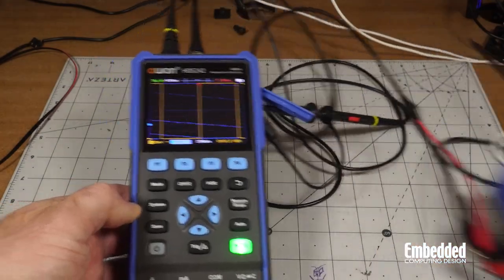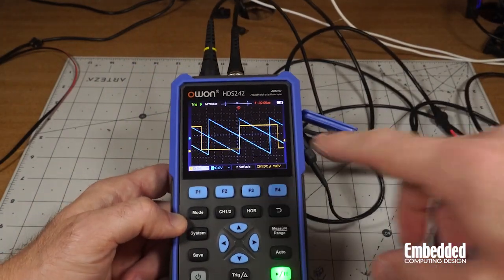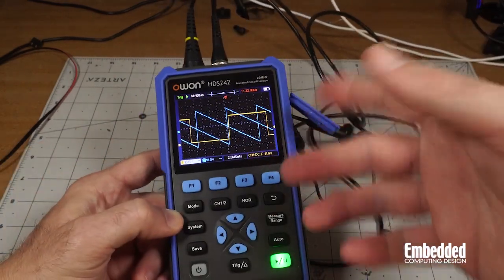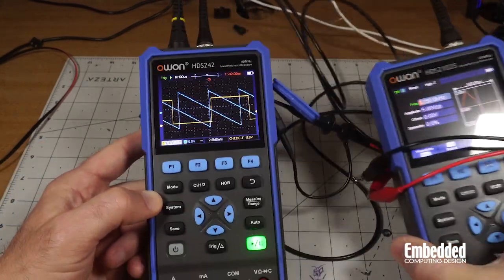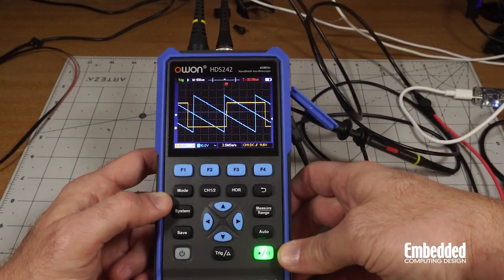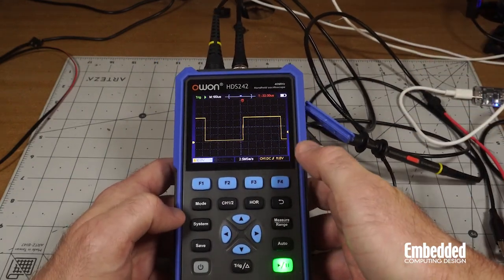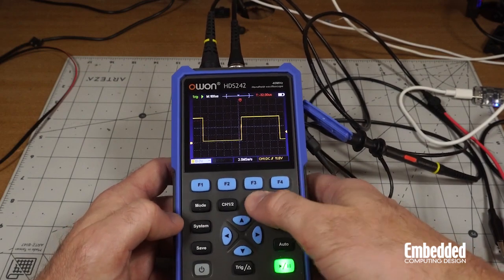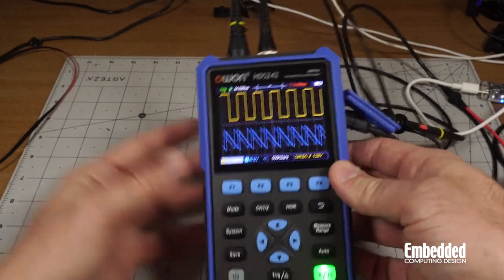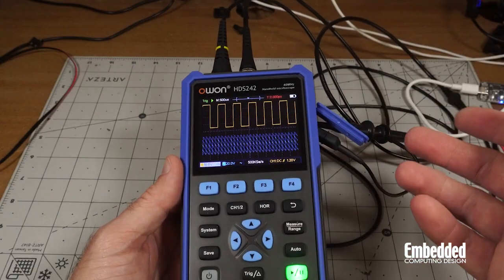They're not really coordinated here, but you can zoom in to maybe get some more usable results. So that's displaying this as a 1.25 kilohertz, and the other one is 1 kilohertz. So it still looks pretty messy. Waveforms aren't coordinated, but you can see here. Hopefully that gives you a little bit of a flavor of the interface at least. Yeah, a lot of cool features here. AC coupling, DC coupling, ground. You can measure the horizontal, vary that with that. It's not a total full review of this, but as far as the interface, I think that gives you a little bit of a flavor about how it works and maybe some of its capabilities.